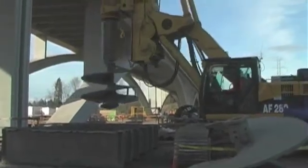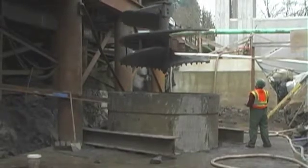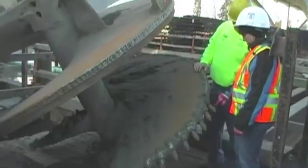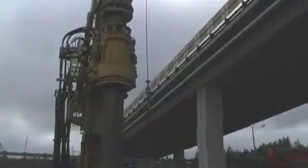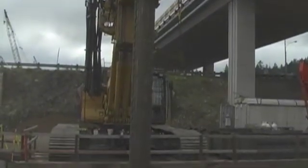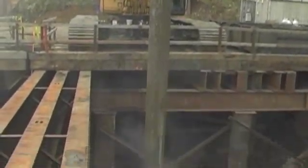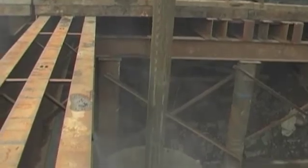Well, the bridges here are constructed in rock sockets, so we're placing a 25 to 30 foot rock socket. It requires several different changes in tooling and a good sized drill rig. The shaft here goes approximately 28 feet from where we're standing in the rock.